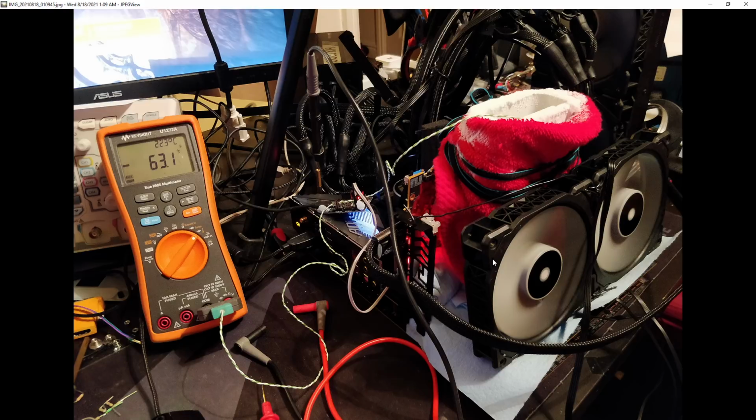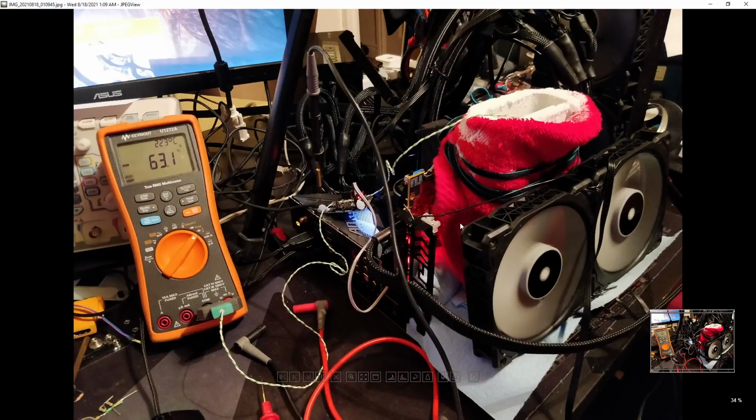So that's super frustrating, is that you can't really take advantage of having liquid nitrogen on these cards very much, because they don't really work very well at low temperatures. They might be really good for dry ice, though, because in my experience, dry ice tends to bottom out at around minus 73-ish. So on dry ice, this might actually be really, really fun to mess with, but on liquid nitrogen, this is just frustration. No end to frustration. So you can't go below minus 75 degrees Celsius.